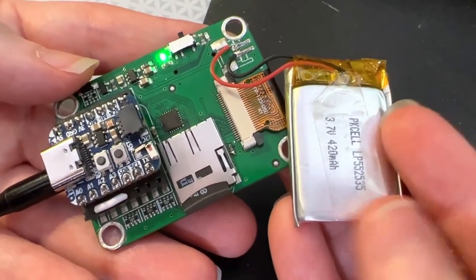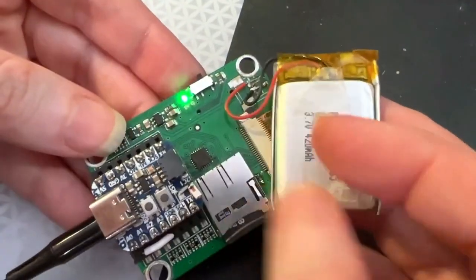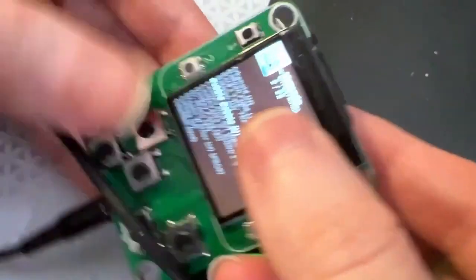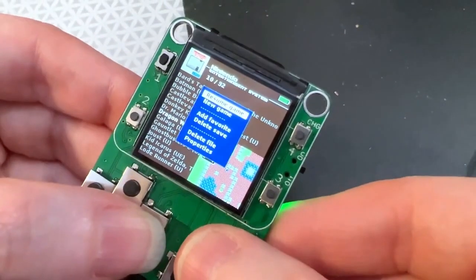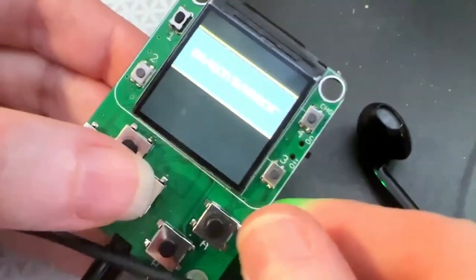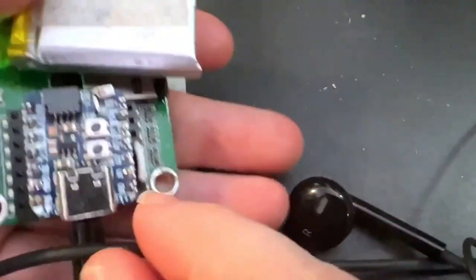Lady Ada, what is this? I've had a lot of success this weekend porting Retro-Go over to the ESP32 CutiePie. It's got an ESP32 on the back — micro SD, I2C expander, on-off switch, a little LiPo battery, and a TFT screen. I got Nofrendo, part of Retro-Go, working. Let's play Dragon Warrior — new game. I've got audio working out the headphones so you can actually play these games. Dragon Warrior is one of my favorite old-school RPGs, by Enix, pre-Final Fantasy. I only made one little mistake: audio is coming out at A3, it should have been at A0, but I'll fix that on the next board rev.